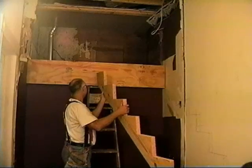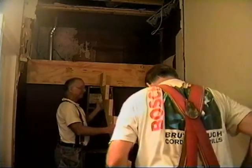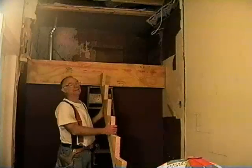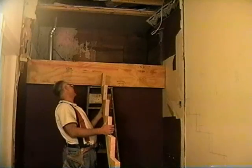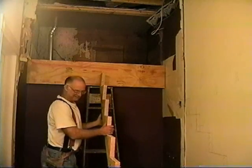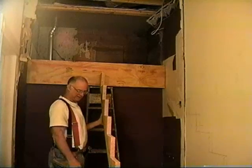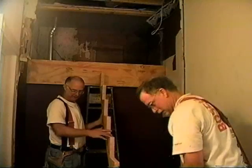All right, get your tape measure. Bring it over 36 inches. Or 35 inches, excuse me. And then, after we put this in, there is no changing, David. Then cross your fingers. John. Okay. You know, exactly, 35. Because you're going to put some trim on the outside, which will make it 36. Right at 35. All right, now what do you got from there to the wall?